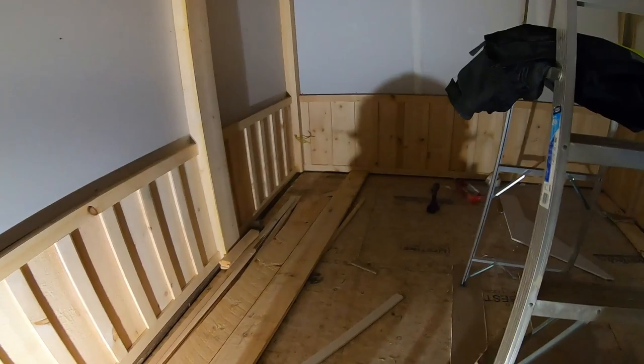Next morning — excuse the mess, a little messy. I was tired sheet rocking last night and didn't have a chance to clean up. Starting the taping. Simple, easy — first things first. Get your mud, put it on the corner of the trowel, hit all your nail holes first. I just go around and hit all the nail holes — that's always my first step. If you have a little paper popping up, take the end of your trowel and hit that paper down. Get all your nail holes first. If it's not deep enough on the first hit, I'll get to draw that one in more.